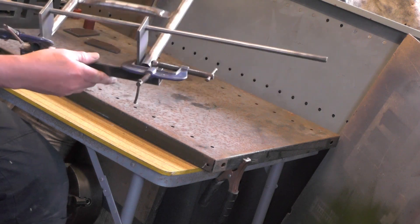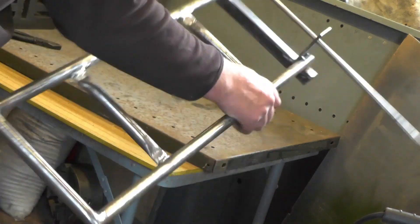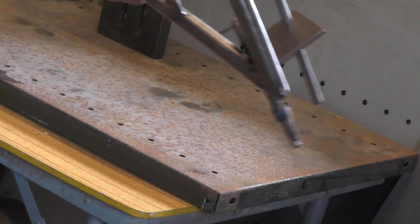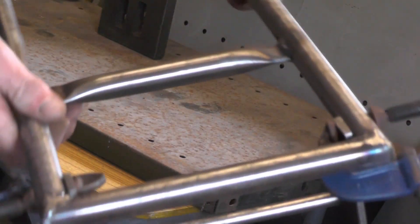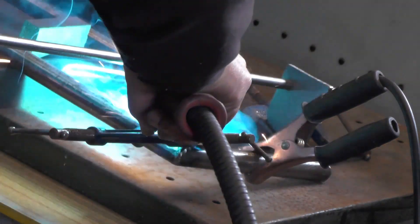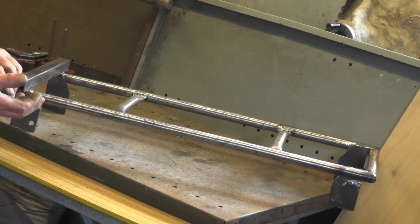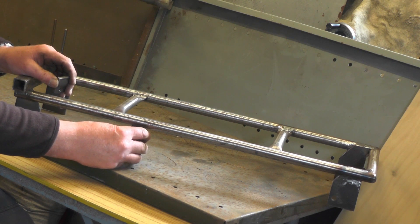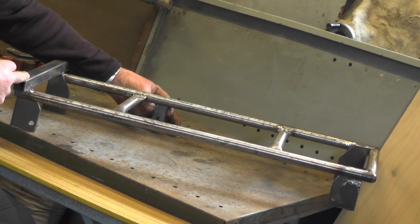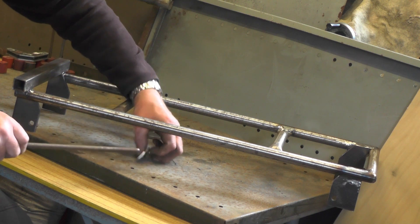Check it's parallel that way, and also looking from the top. The back ones are going to come more or less flush with the top of the tubing. On the front, I've just got the brake lever arms and fixing arms to weld on — one on each side underneath. I'm going 10 inches from the front to that position, and that's where the brake shaft pivot point will go through.